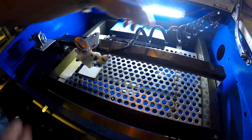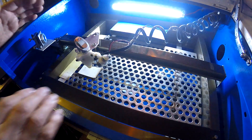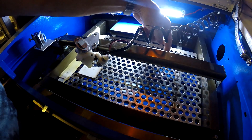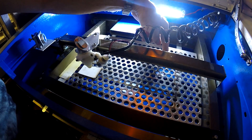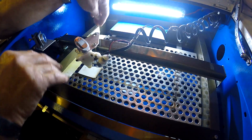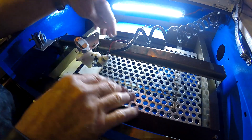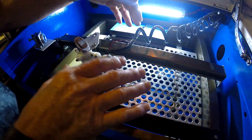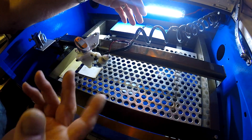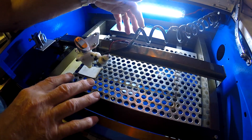You're limited in how far down you can go to the shelf level, but that's not a problem. If I want to go down further, I've got holes in the base of the unit. I just take the bars out, drop them through the holes — which still allows me to adjust them — put the bed on top and adjust it up. I don't tend to put anything thicker than an inch in here, but it still gives you that flexibility.